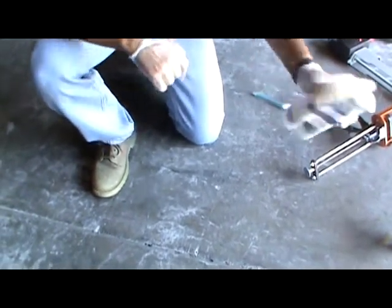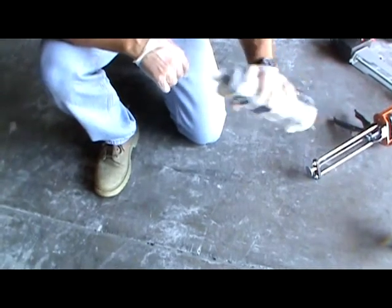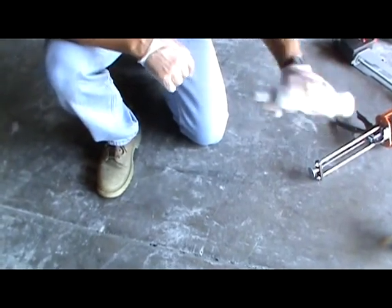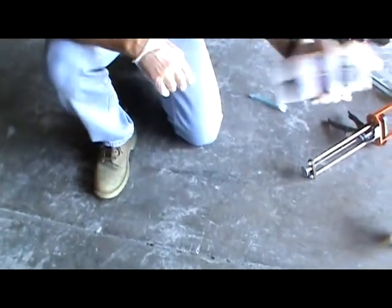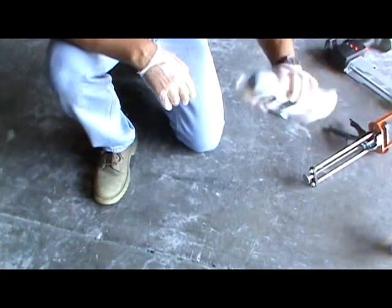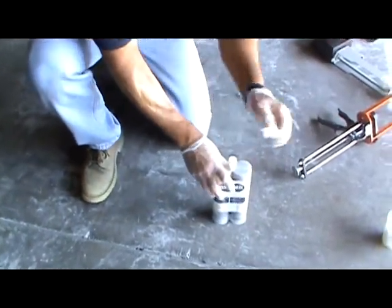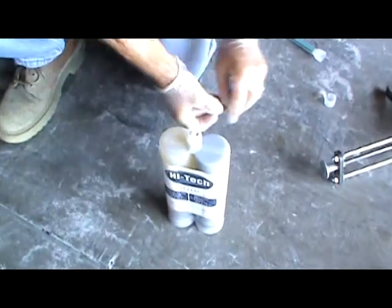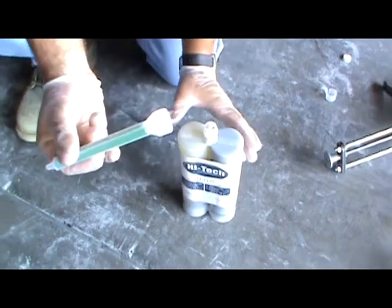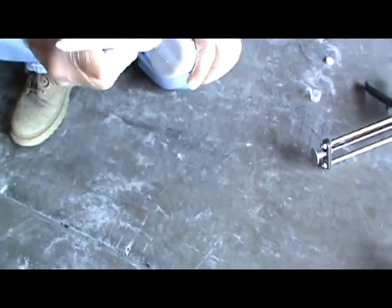It's very, very important, especially in wintertime, to warm up the cartridge before you start to shake it. That lowers the viscosity and makes it much simpler to shake and more successful to get the polyol side blended completely inside the cartridge. So after 60 seconds of shaking, it's very simple. Go ahead and pop the cap off, take off the top cap, take our mixing nozzle that we supply with the cartridge and screw it on the top.